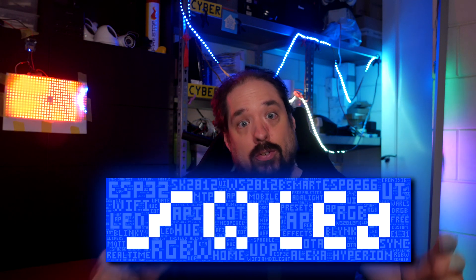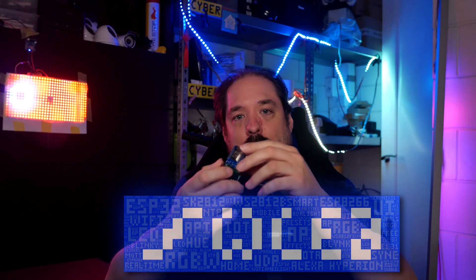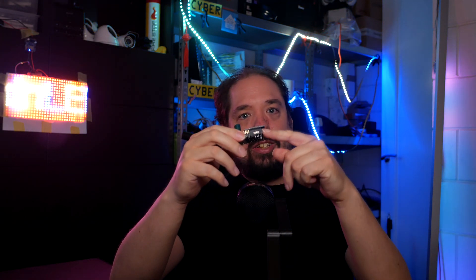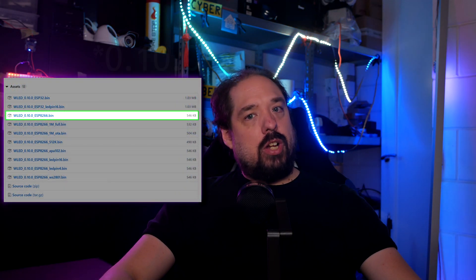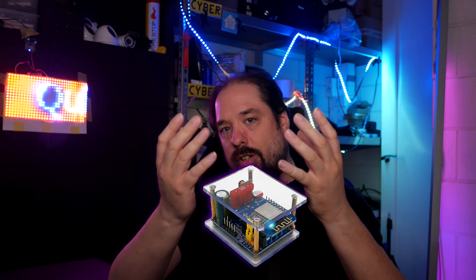So complete, in fact, that it comes with the excellent WLED firmware pre-flashed on the board. Thank you Aircookie for allowing me to do that. So now it's literally taking it out of the bag, hooking up some power wires and the LED wires, and turning it on — and you can connect with your phone. That's it, it's awesome. A small side note is that the board comes with WLED 0.9.1, but I recommend updating to the more recently released 0.10.1 version. Or since it's still a DIY board, any firmware of your choosing or your own code — have fun with it. In addition to all of this, the international shop also lists some extras at the bottom of the page, such as a little acrylic case you can add.